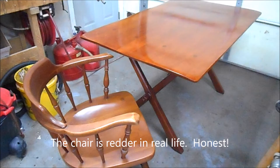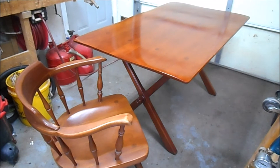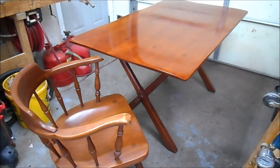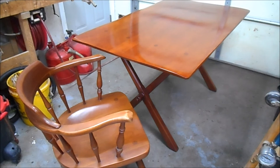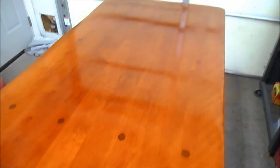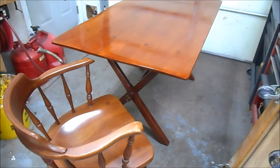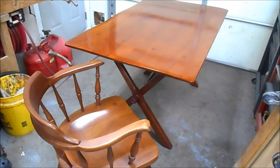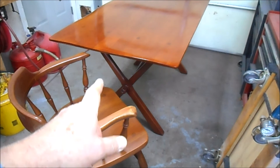So here's the color match we've got. Basically I shot a lacquer coat over the glaze, then came back with some toner — I mixed burnt umber dye stain with some lacquer thinner and a little lacquer for bite, as you've seen me do before, and sprayed that on until I was happy with the color. We're right where we want to be. Those stains — although you can find them if you look — just look like grain now, and that's good. I'm real happy with the way this turned out. From our shop just outside Kennesaw here in North Georgia, best regards, thanks for watching — remember, it's just wood, color, and some shiny stuff.